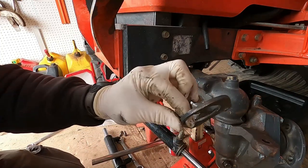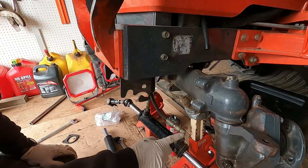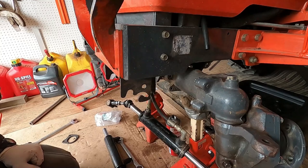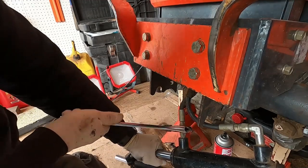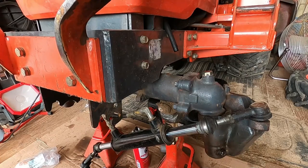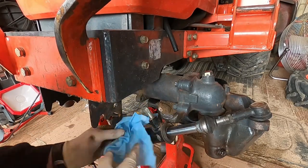The other bracket is off — you can see the oil on it, so it's been leaking on one of the outer seals. I did not have access to both hydraulic lines from underneath, so it looks like a fitting has to come off of here. We're going to take this one off first, then take the fittings out. I just want to make sure I wipe all this off so I'm not getting dirt inside anything, because we do have to take the rest of the fittings off.